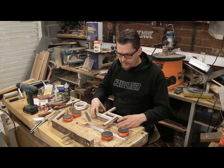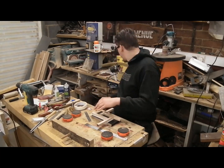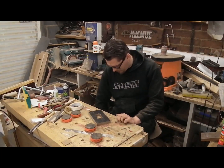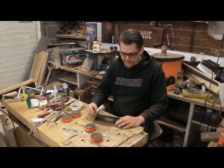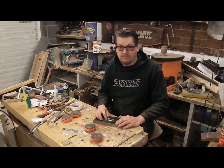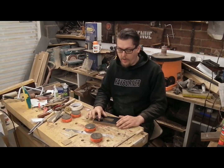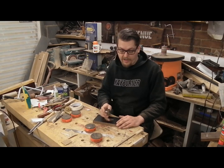So essentially we put that to one side, drill a big hole in the middle, crack out the router — and that's routed out. I'm going to test it with the cover, which drops in nicely. If I flip it upside down you can see the wiggle room a lot easier. We've got half a millimetre all the way around — that's pretty good. On Filtertrons the corner radius actually matches the same radius as my router bit, so I don't have to file or clean up these corners at all.